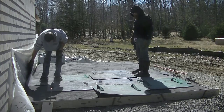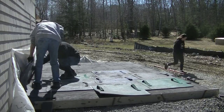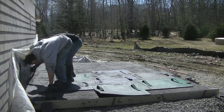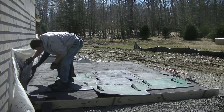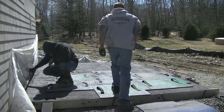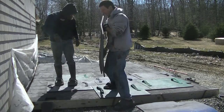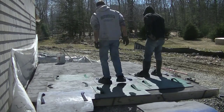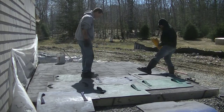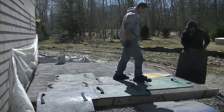So we're just moving along. When we pick up a stamp we look at the impression it leaves — if it leaves a good impression then we'll move it on. If not, we'll set it back down and tap on the stamp again a little bit. You can see Darren has got a little tool there he's using to make sure all the grooves in between the stones go all the way to the building. He's touching up a little piece there with that little yellow touch up mat.